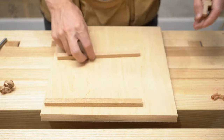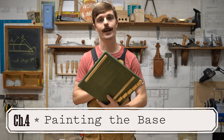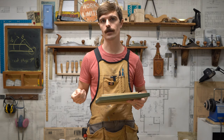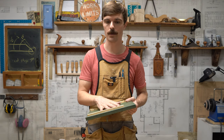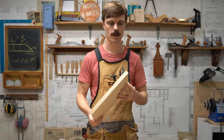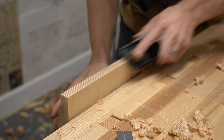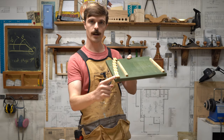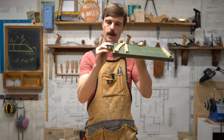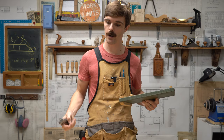You can see it's starting to look like our angle setting jig. I like to paint the base — this protects it from slurry, which is a mixture of steel and water that will come in contact with the jig, so I think it preserves its life and looks really nice. Before painting, I'm going to chamfer a few edges to soften it up. It's important not to chamfer the edge right by the stop blocks — the honing guide has to butt up against that edge and you want it crisp. You can chamfer every other edge on the bottom.